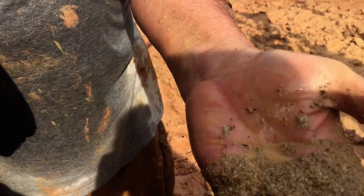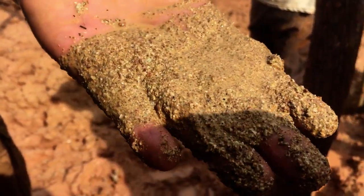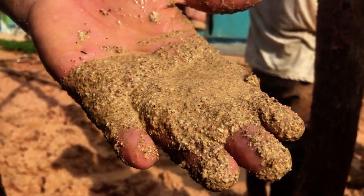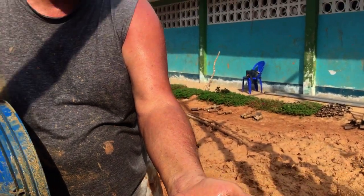That's a really good sign — we're probably in a water sand right now. We'll drill down a little bit deeper, then clean the hole out and see what kind of recovery we get. I think this is looking really good because this is a coarse sand, and that's usually what you're looking for to find a water strata.